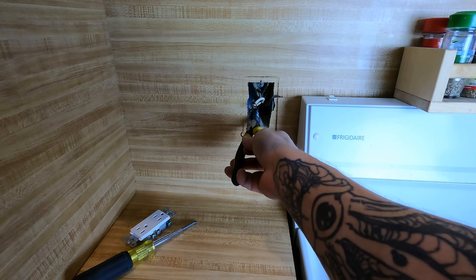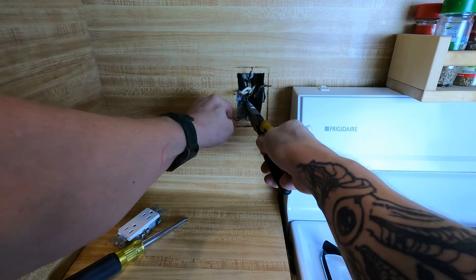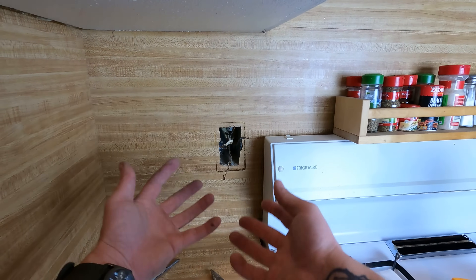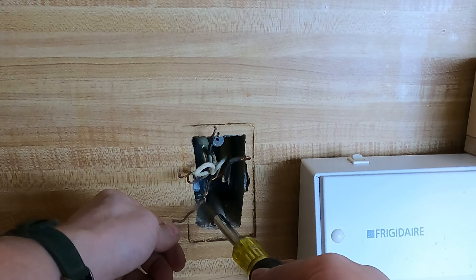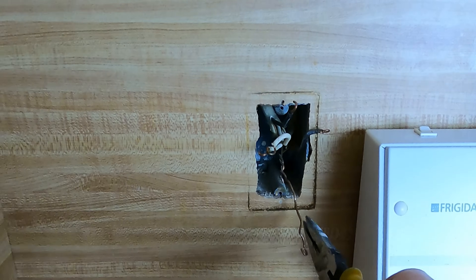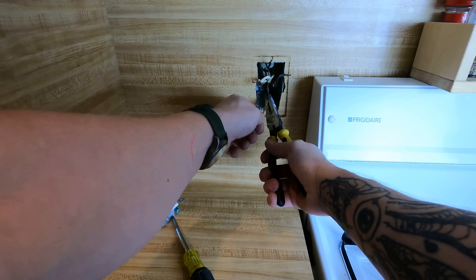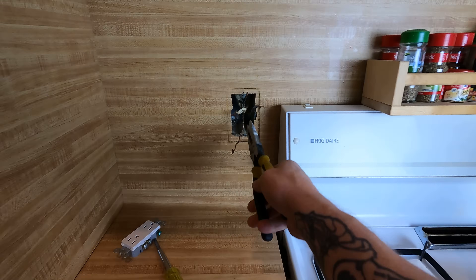Why do you cut stuff so far back? It's just not necessary. At some point an electrician knows that he, she, or another electrician is gonna have to come back and deal with this. Another thing not to do: don't just twist the wires together like this — these are actually really loose. You need to put a wire nut on that, or a crimp sleeve, to make sure this ground does not come apart. Grounds being solid and not coming apart — very, very important.